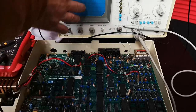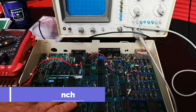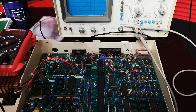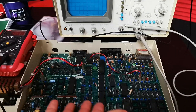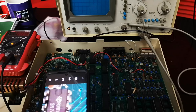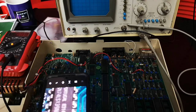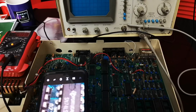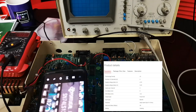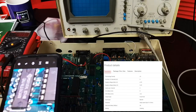What can stop these machines from booting and displaying basically rubbish could be this series of ICs here. So I'm going to check the actual data coming to these ICs themselves. We could use the logic probe, but that only basically tells you if there's any kind of data or pulses coming through. I want to see it visually, so I'm going to use the oscilloscope. My initial thought — I'm just trying to help you see it because the writing on these doesn't always get picked up by the camera. It is the SN74, and these do go bad and when they do they won't boot properly. So it could be literally one of a bank on this machine.